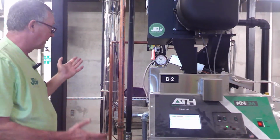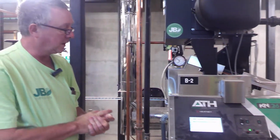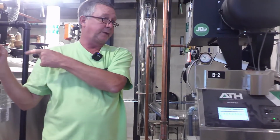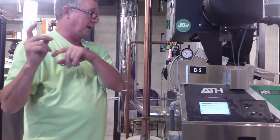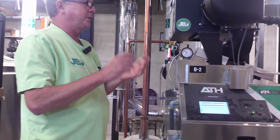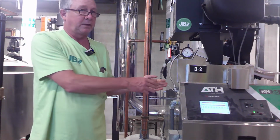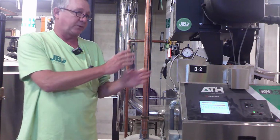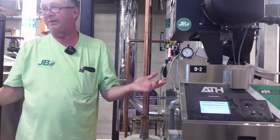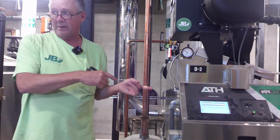For the safeties, that's really all there is. The other one you might see is a local flow fault. Because we have Belimos, it's relying on flow from the pumps on the floor over there. So if those aren't on, and the BMS should have all that in line. The sequence should be turn on a pump, let the pump run for a few minutes, and then start operating a boiler. I had one where it was backwards. They kept trying to start the boiler before they fired the pumps, and it kept going to flow fault. And I said, guys, reverse it. Start the pump, then start the boiler, especially with Belimo valves.